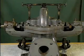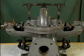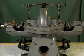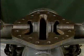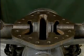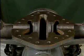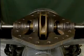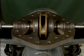The casing of a centrifugal pump serves several purposes. We can see how these purposes are accomplished by looking at how the inside of the casing is shaped. One purpose of the casing is to contain the fluid being pumped and direct the fluid as it moves from the impeller to the volute and out through the discharge piping. The casing also houses the internal parts, holds them in their proper places, and protects them from dirt and damage.